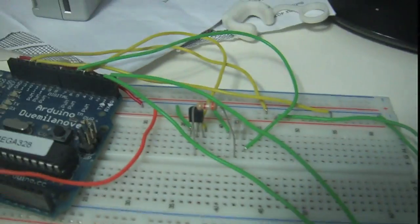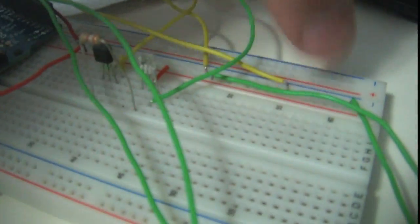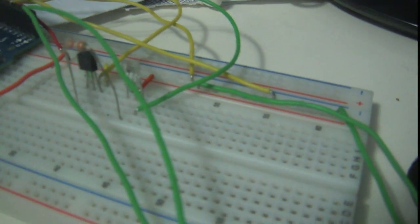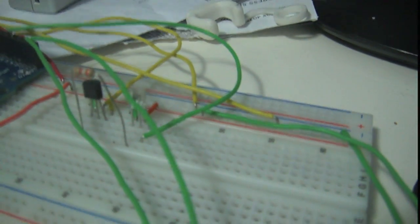As you can see here, I have the two sensors. The zoom's not going to work again. But right here, this black one is the temperature sensor. And this clear one, that's the light-to-frequency converter. And then I also have these two yellow wires that I can just move high or low to simulate the water sensors. With the water sensors, there's going to be two of them — one of them is going to sense a low water level and the other one a high water level.